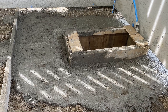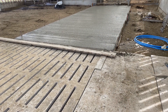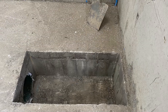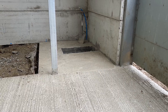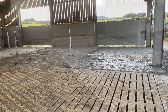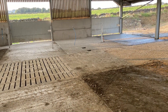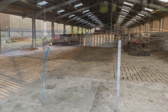The final part of the build was now underway. We just had to finish the last section of the building off. We started by laying the concrete passageways first, just matching up to what we'd done earlier. We did create a sump, which was made for the robot automatic scraper which will come at a later date. The concrete went well — just laying the walkways or passageways first, and then we started to prepare them for the cubicles or the cow stalls, putting in the posts in the right position, quite accurately measured.